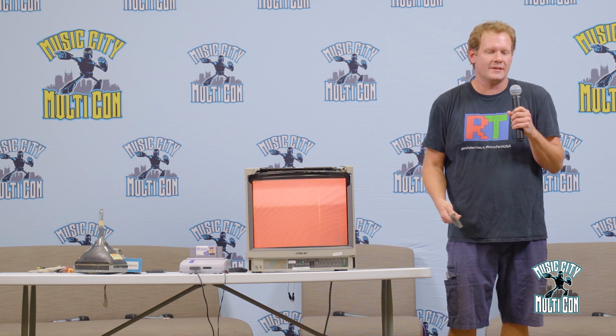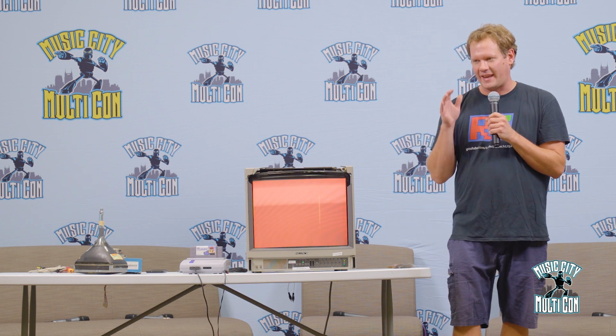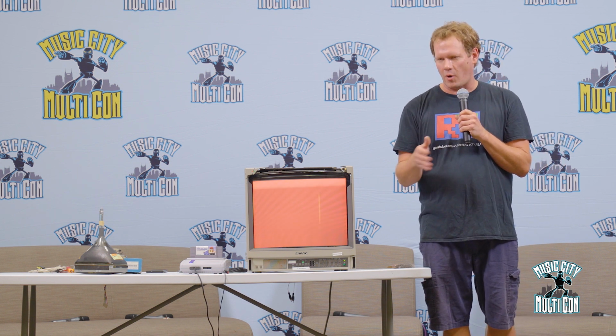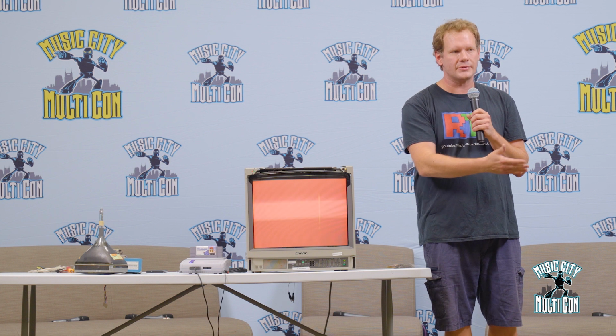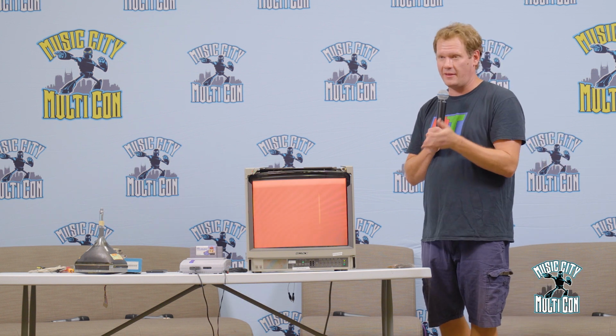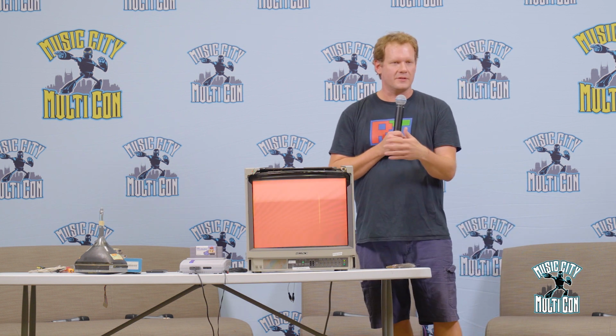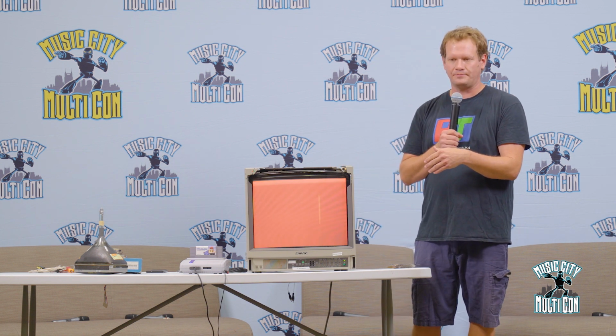If you have access to an air compressor, that would be fine too. I would just say watch air compressors because they can throw moisture, like water, that can get built up in those. So if you do use a professional air compressor, they're highly effective, but you might want to give the CRT a little bit of time if you suspect there's any kind of water in your line.